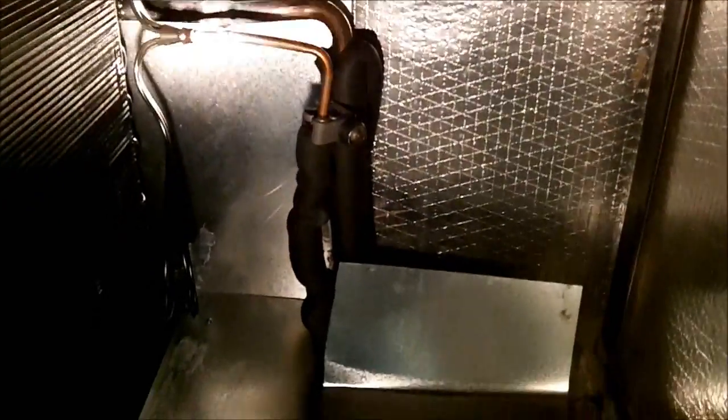I got the coil all screwed in, got her welded up, put a piece of metal back there to protect the insulation, and put a piece of metal down there to protect the pan. One little thing did fall off, so good thing I did that — didn't want to have to buy a pan for this unit. We'll get a vacuum pulled on it and get her charged up, then put the blower and heat strips back in.